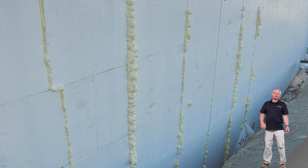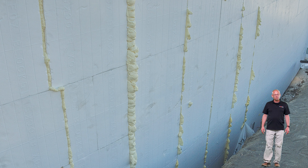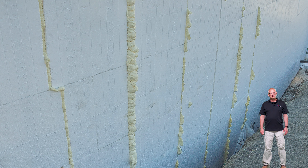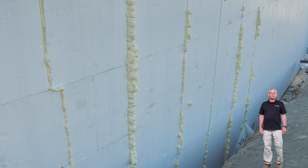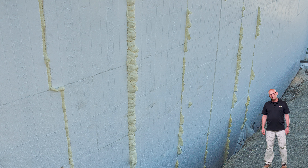On the outside you can see this big curved wall. We filled the gaps — some up to an inch and a quarter wide — with high expansion spray foam. Don't use window and door spray foam; that's an insulation, not a glue, and it rarely works for anything other than windows and doors. Use a high expansion polyurethane spray foam. I like Great Stuff — the black cans work really well — but any good brand will do. We didn't do any strapping; we just poured concrete, put a vibrator in, and it all held together quite well.